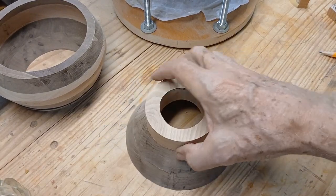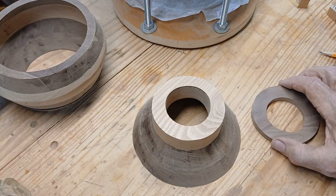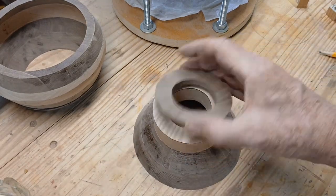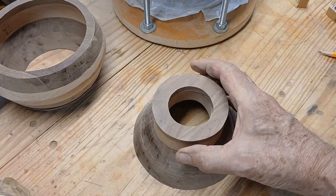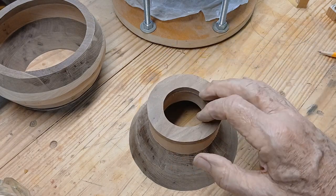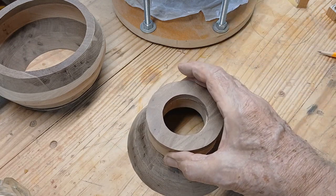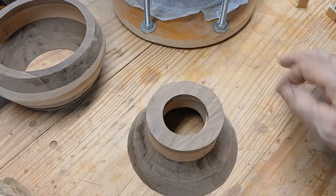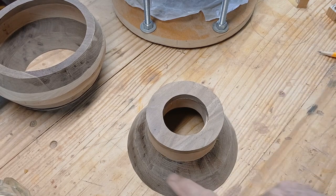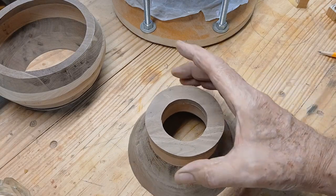That's glued together, though I did kind of mess up — I missed a step. I misinterpreted what she was saying about the walnut in this step for making this ring. I was supposed to put an additional piece on there also. She was referring to trimming some excess walnut from a different piece than I thought. So I just set that piece down on the blank, traced it, went over and cut it out leaving a little extra, and we'll glue it on and put it in the press. Then I'll sand it so it all matches up. We're going to round this down, sand it all down, give it a nice little transition, and make all these joints fit real nicely.